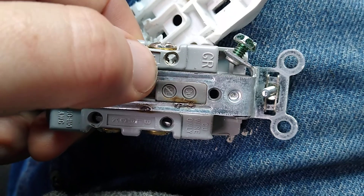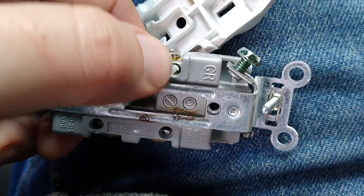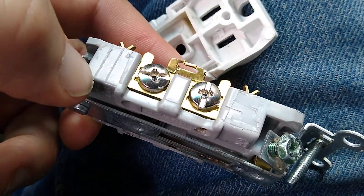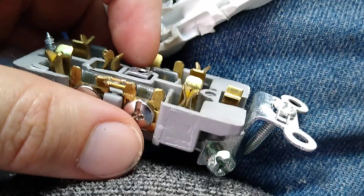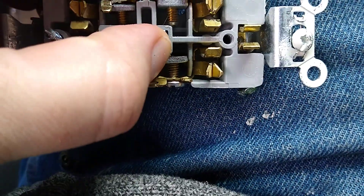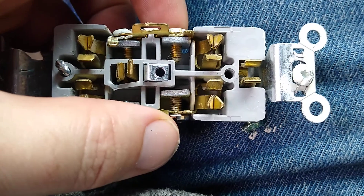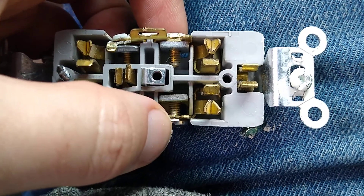This side had the white wire put in, but it maybe was extended too far. There is a gauge on the side that says how far to strip the wire, and it wasn't that far off. But you can see here that it goes in and this is supposed to get pulled in to clamp that wire — and it was doing that, but it didn't do it well. I think this clamped onto the insulation instead of the actual wire.